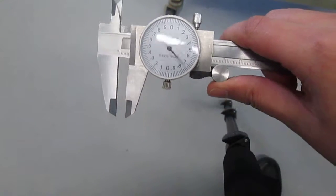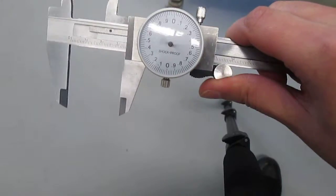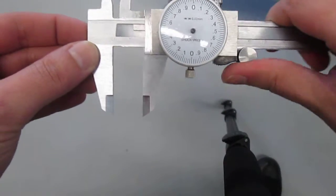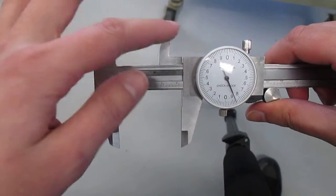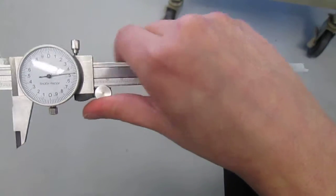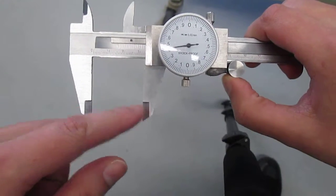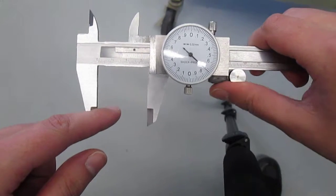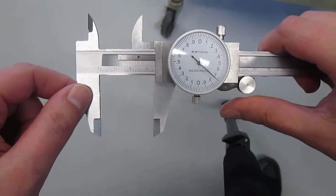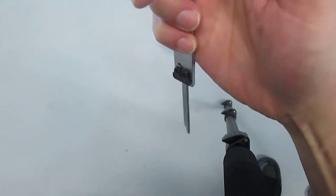And what I'd first recommend is placing your thumb here on this part and getting familiar with opening and closing the dial caliper. So here you'll notice this opens and spreads apart. So do the two pieces on top. And then you'll notice on the right that piece extends down as well. So these pieces are used for measuring widths or heights. These pieces are used for measuring inner measurements or inner diameters, and the piece that extends out the right is used for measuring depth, which we will look at in a moment.